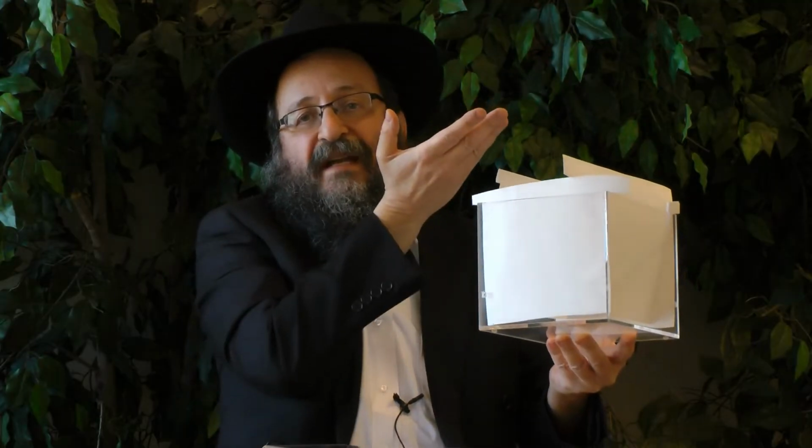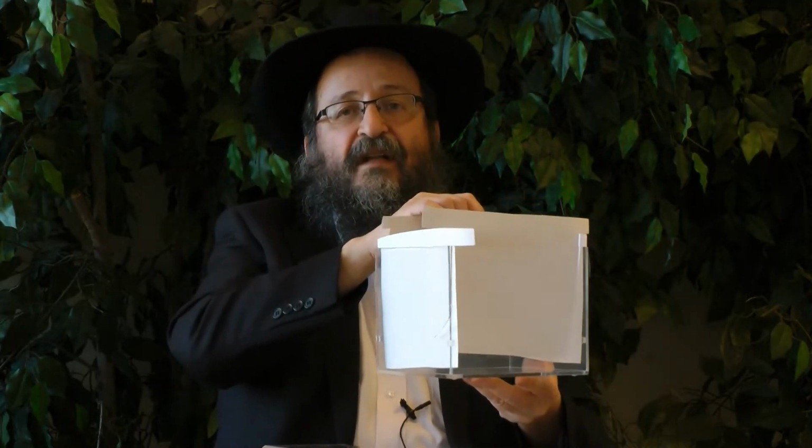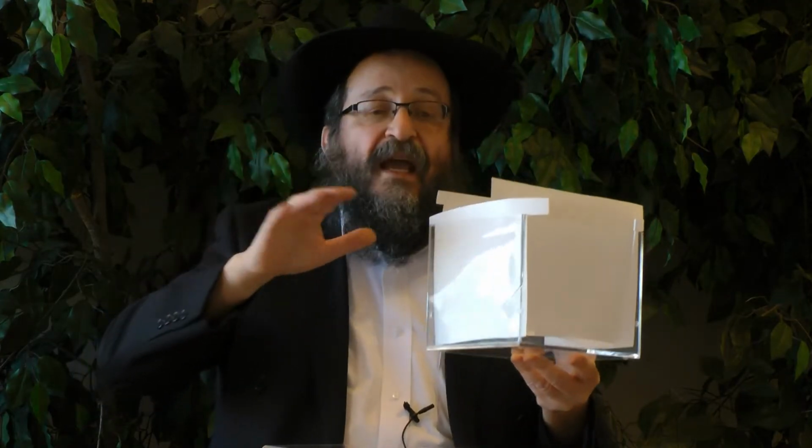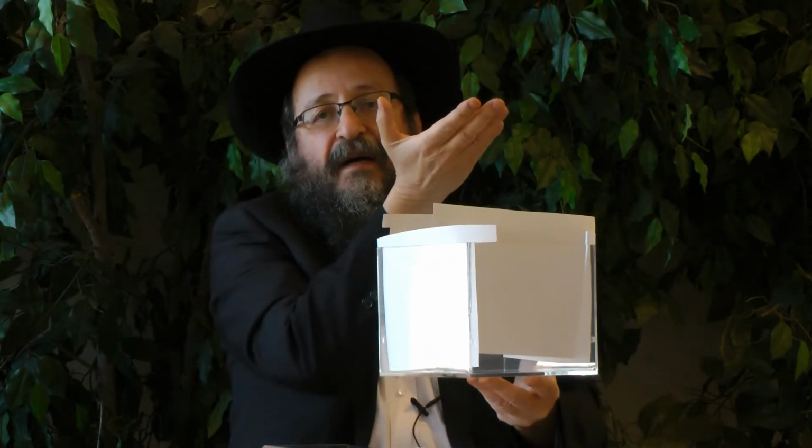But you don't have to worry, like water. If you put in water, the middle will automatically pick up. With cement, it doesn't work that way. With cement, it's so heavy, if you start with the middle, let it rest for 10-15 minutes, and then you start pouring the sides, it won't push the middle to come up.